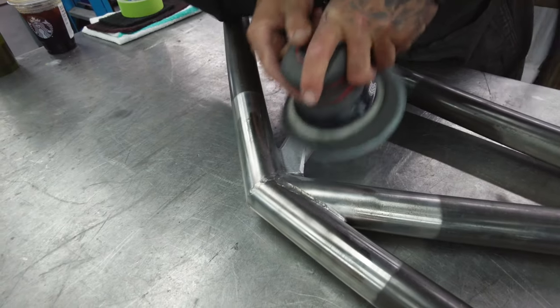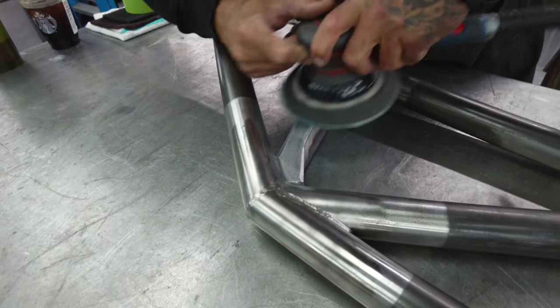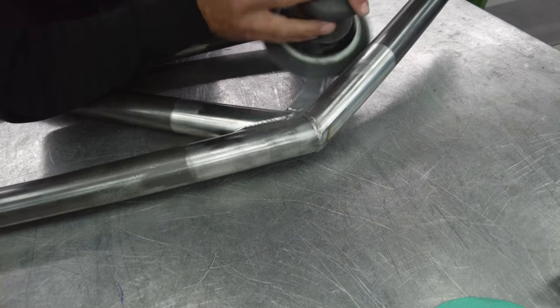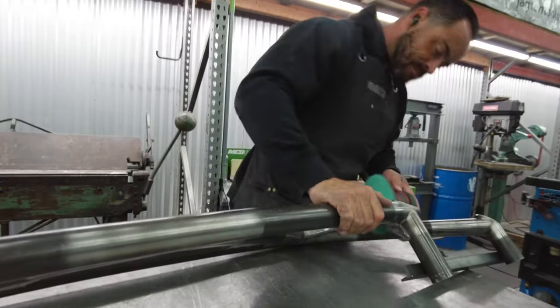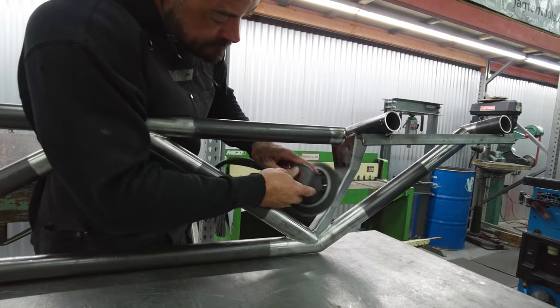You know, keep in mind with this stuff, like, you don't have to re-DA this stuff. You don't have to sand these edges. It's just to give yourself the best, cleanest chance on a lot of like your plate work stuff for sure. Just taking any chance of contamination out, and then also bringing consistency into that edge. That's a huge help.